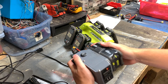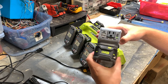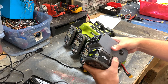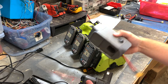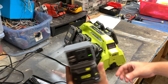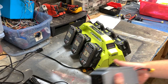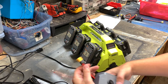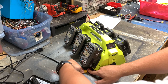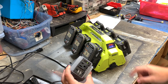I essentially made a whole modular connector thing. I know Ryobi has one now, but this is my cheapo $20 variant since theirs is $50 or $60. It's a nice little 3D-printed thing — I could probably link my Thingiverse page in the description. This plug, as you can see, gets the green light there. This was purely for testing — ideally it wouldn't be in the final build. You can plug the XT60 in down here, flip one of these switches on, and there you are — 20 volts output to your inverter.